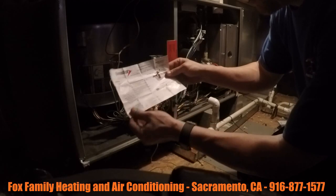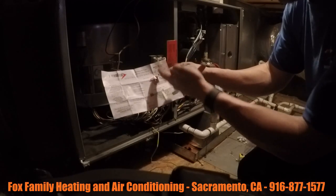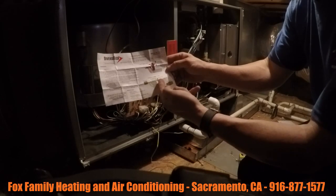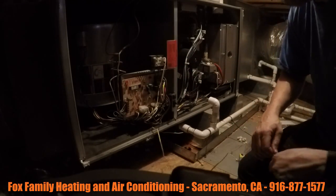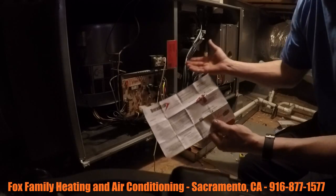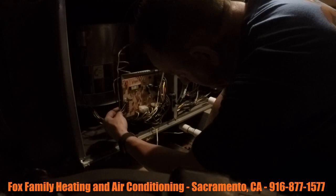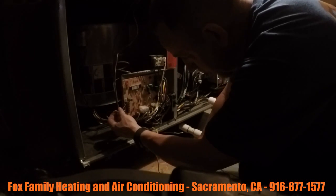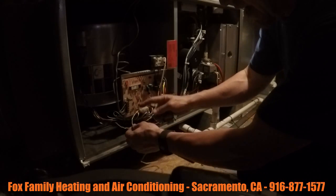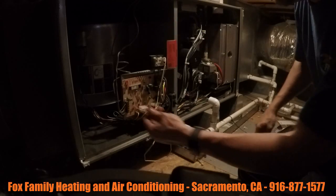Just like the instructions say here — anything you get from the warehouse, you're going to have instructions that go along with it. It talks about how you want to make sure that this float is in the vertical position, straight up and down, no matter how this is mounted. Typical connection for this is to wire it to break yellow for the condenser out there. They want you to break yellow so that the system would only blow air. But this is a condensing furnace, and in general I go ahead and just break red on the thermostat. So of my thermostat wire coming in to the terminal on the control board, I'm just going to take that one out, hook one side of it up to that, hook this side up to that — basically power is coming out of the wire here, running down to the switch, coming back up through here, and then on to the rest of the thermostat wiring so it can communicate that way.